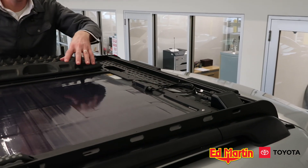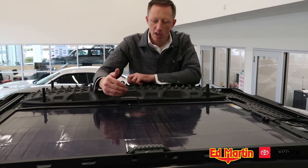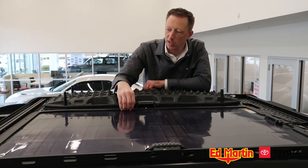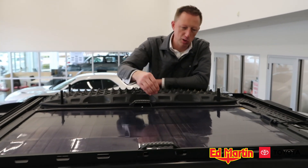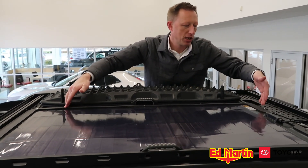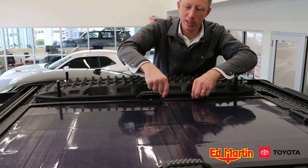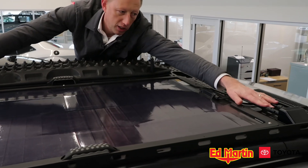It's kind of a semi-permanent fixture. We had a local shop — ZR Tactical here in Noblesville, and I'll link it in the comments below — cut out a polycarbonate board. This is a two-piece setup: there's a base polycarbonate board cut out for the exact size of the panel, and then another ring around it to keep it squashed down. These are mounted from here with IP68 waterproof connections for the solar.